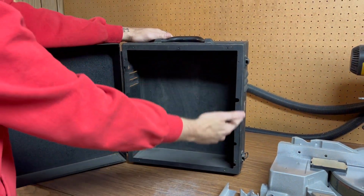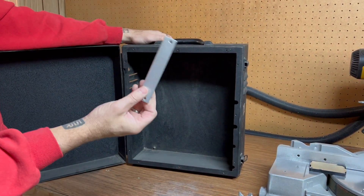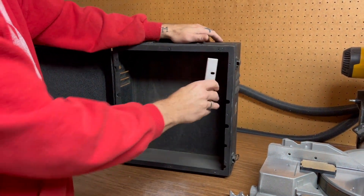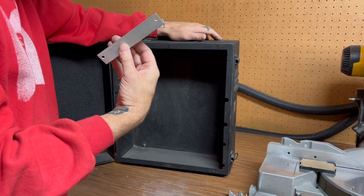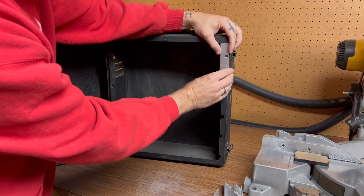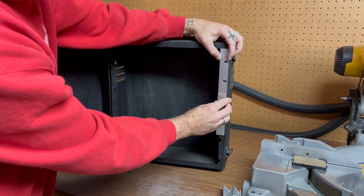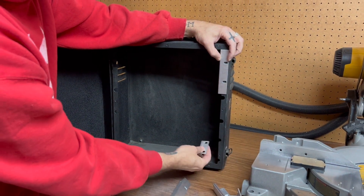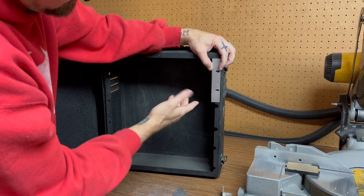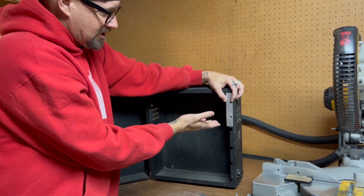But this case has this lip around here, so I'm going to be using our 19-inch style brackets — you don't have to go with the 19-inch rack — but these style brackets normally go into some kind of rack. We've got two different kinds: the internal case brackets, and then these right angle brackets. I'm going to line up two on each side, and then down below we're going to have two of the one-inch right angle brackets. You can cut your rail to length on our website at synthrotech.com — you can get any length you'd like and it's very easy to order.